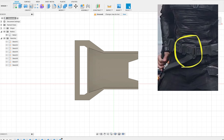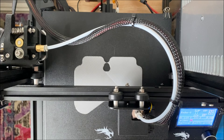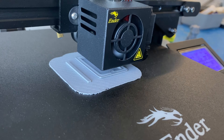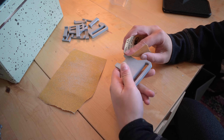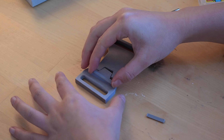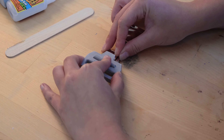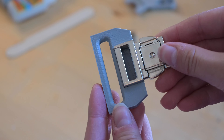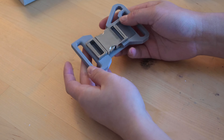Moving on to the harness and the belt now. I started out by 3D modeling all of the hardware in Fusion 360. I then went ahead and printed everything and then sanded my prints down so they were nice and smooth. Next I assembled the main buckle of the belt. This buckle is really cool because it's actually a shell that goes over top of another pre-made buckle. This means that the inside is super sturdy and is going to function for a long time, but the outside is totally custom made, and you don't have to worry about the flexibility of whatever filament you're printing in.